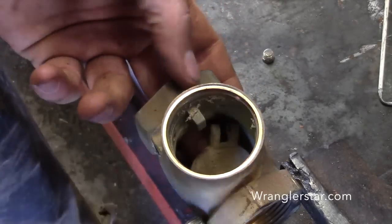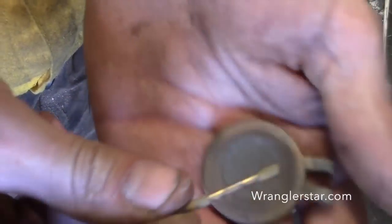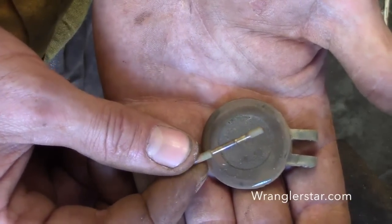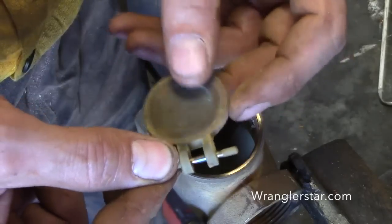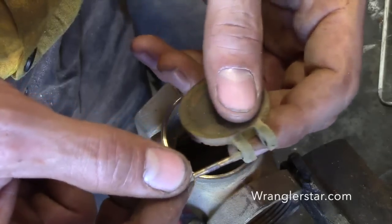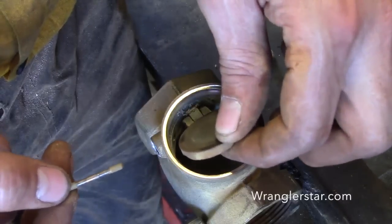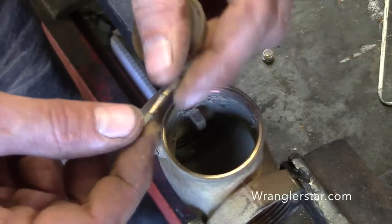It's just beyond me why anyone would design a measuring system based on logic and science when they could base it off a proper form of measurement like a barleycorn. There we go — I see the problem already. Look at that pin — see how it's thinner in the middle and thicker on the outsides? That's not supposed to be that way; it's just worn from working back and forth, maybe millions of times, several times a second for a year. That's why it's so sloppy. Let's take the pin out of the other piece since it doesn't have as much wear.